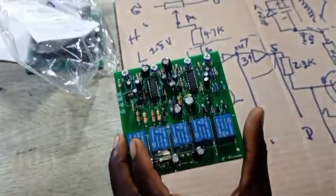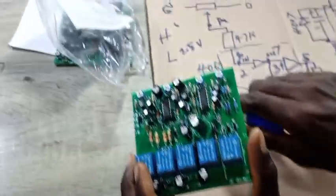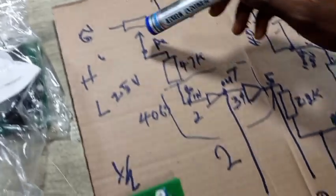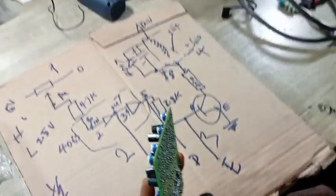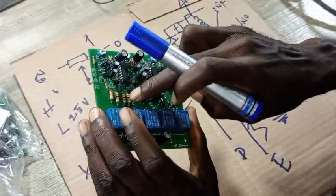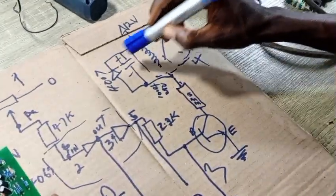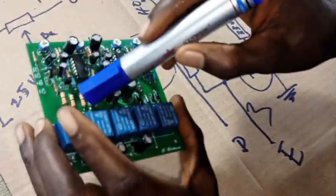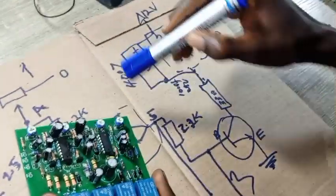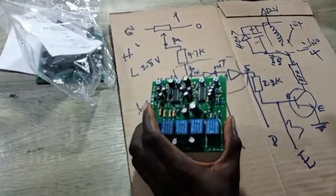Once again, watch this video and study this very well. Pick a stabilizer, make an experiment: put one probe on the ground and get your voltage at all these points — A, B, C, D, E. At times when you look at some voltages, all of this place got burnt — it is the transistor that got burnt. So meaning either the transistor is bad, this diode is bad, or the relay is bad — those are the three things that normally blow off. Once again, thanks for watching. See you in the next video. God bless you.